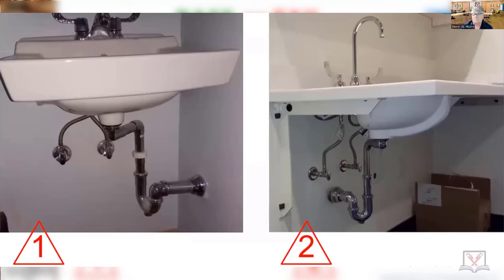The other piece Ethan answered — jam nuts. How many of you have seen a white metal jam nut? Justin and Nicholas: mostly on basket strainers, exactly. This is good knowledge coming from people in your own trade right here in class. You're not seeing a PVC jam nut on a piece of straight waste — and not everybody in the room has their hand up when we talk about jam nuts and gauge of metal. That's the kind of stuff that should wake you all up, because you can't go into homes and do this work without being aware of all these pieces.